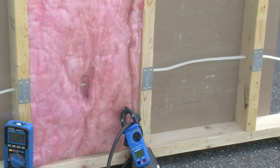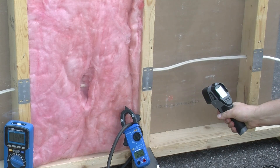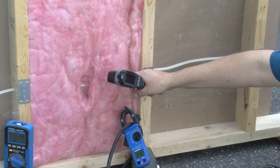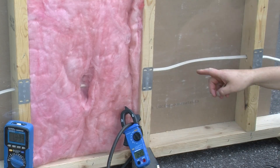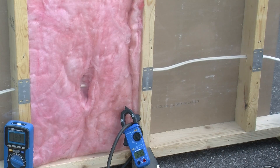We'll crank up the current to 40 amps now. I'm seeing about 56 Celsius in the insulated cavity, about 30 degrees down here at ambient, and up at the wire about 36 to 37 degrees. A considerable increase in temperature, as we would have expected. I did a back-of-the-envelope calculation, and each section of wire is dissipating about 25 watts at this current. If I feel the wire, it's now too hot to touch for any length of time — it's not melting yet, but it's probably pretty close.